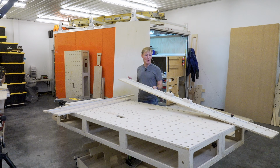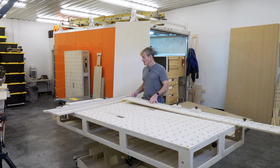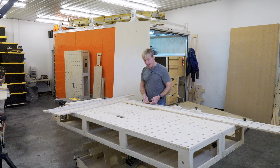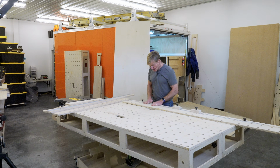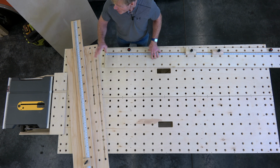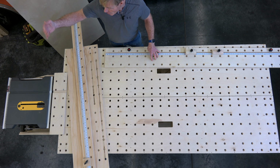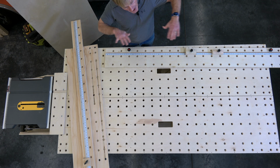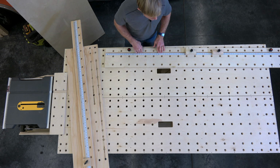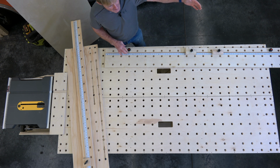This is the Paulk Smart Crosscut, the PSCC. It is now down to a single piece rather than two pieces. And that T-track that created the backstop, the squaring, is gone. I have made my own T-track in this, just the way I did on the fences for the router table and also for the extension tracks on the miter saw. These tracks have been working out really well, so it made a lot of sense to just cut my own, and of course I could make it as long as I needed to make it.